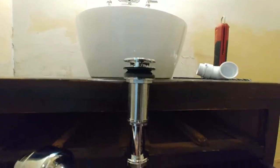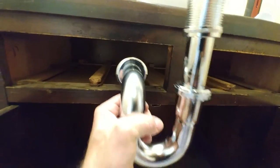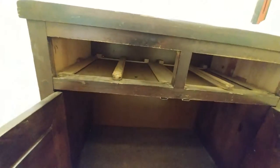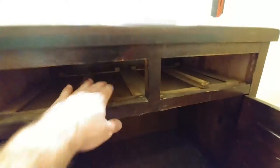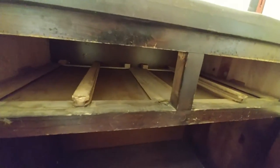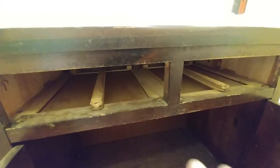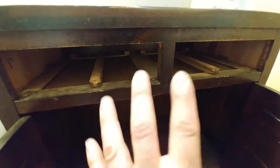Stacking things up at the edge, I can see I'm not going to get below the drawer plane, which means the trap run would completely interrupt the drawer when it's fully in. The drawer would have to be modified — you see that notched-out drawer in typical sink-base vanity cabinets. I was hoping to stay centered here. Rather than just a circle cutout, I'd have to take a cut all the way to the back. I think it's worth doing: drill through the top, come tangent off that hole straight back on both sides making a big notch, drill in from the back, and create a pill-shaped notch all the way to the exit. Both drawers stay intact and the trap exists in the space between them.